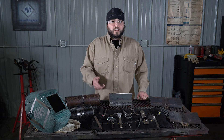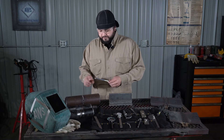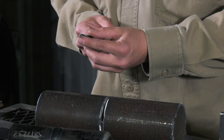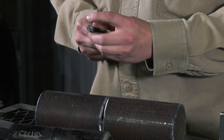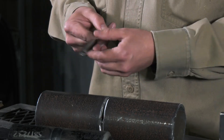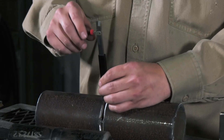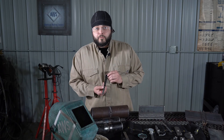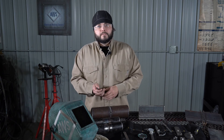The next visual inspection tool we're going to look at is the high-low gauge. The high-low gauge helps us measure the root opening and the offset of the weld joint. We're going to show you how to check the offset of the pipe using the other end of the gauge. Draw these two legs through the root opening, catch the inside of the pipe, and let it place flat on the surface of the material. Tighten the knob, pull it out, and check the measurement indicated on the hash marks of the tapered wedge. Draw it in, rotate it so we're catching both pieces of material, tighten the knob, rotate, and check. In this case, we're very close to perfect, or zero — so there's virtually no offset at this point in the pipe. You would want to check all the way around the circumference to make sure the alignment is correct. And that's how you use the high-low gauge.